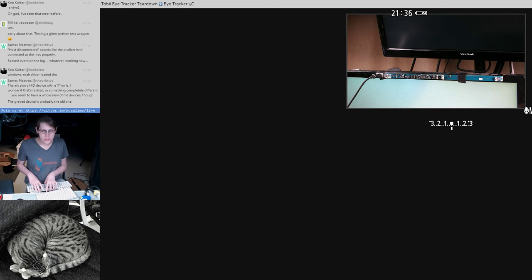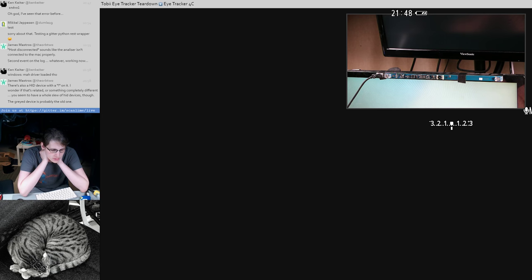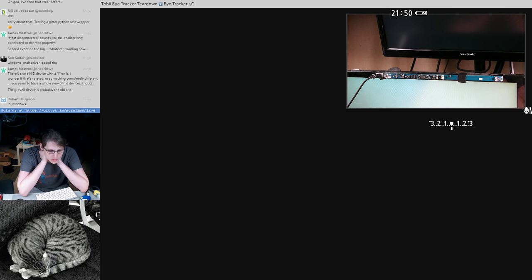Maybe we can take another look at the circuit board. It's tempting to just dump that SPI flash. So, its USB interface had one interrupt endpoint, interrupt in. And that's usually the kind of thing that you would use to notify when buttons are pressed or potentially maybe when frames are ready, something like that.